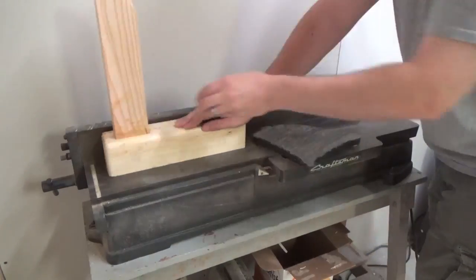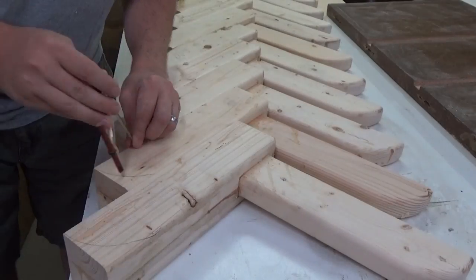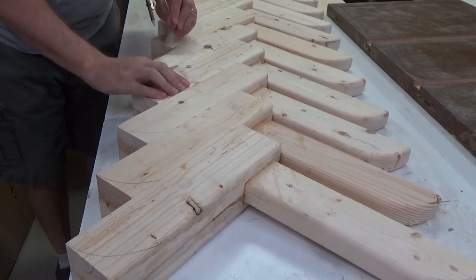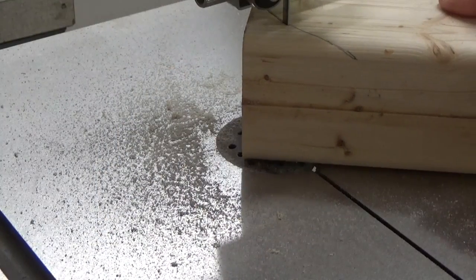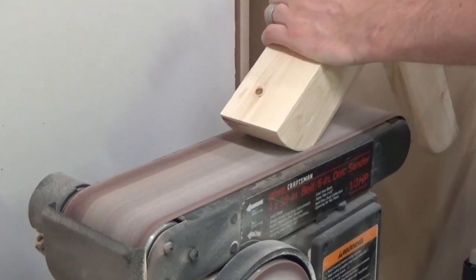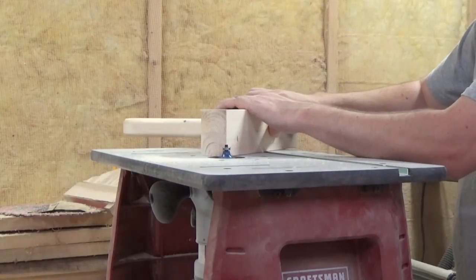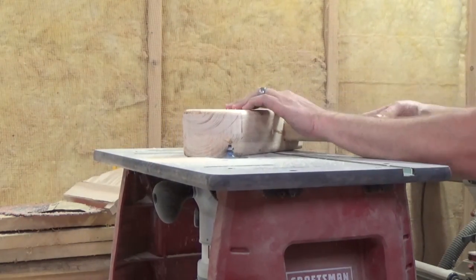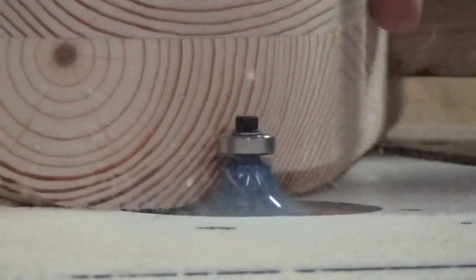Once they were dry and out of the clamps, I ran each one over the jointer and made the back of it perfectly flat. Then it was time to make each one look like a lopsided boomerang by drawing an arc onto the bottom of the brackets, and then back to the bandsaw to cut out each one. I used the belt sander to smooth out the curves and sand down the sides of each one. Then since I reintroduced even more sharp edges, I had to finish out the round overs on the router table, going backwards on the ends just a bit to eliminate any chance of tear out.